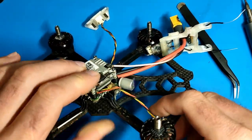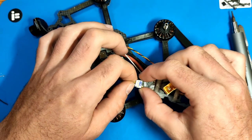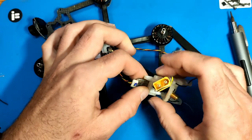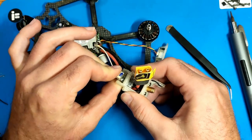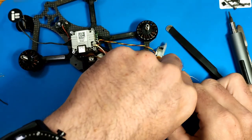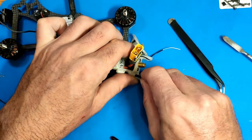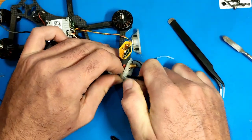When that's done, go ahead and give your VTX a little press, make sure it's damped properly and nothing is stuck in between, so we won't have any issues with vibration on the FC. Then plug in the prepared RX plug back in — in my case the FrSky RXSR receiver — and put it back into your TPU. I also realized that the RX antennas, especially the antenna ends, were installed very poorly. That's why I used the original antenna protectors and pushed them into the TPU, making sure the antenna ends are straight, because that has an impact on signal.